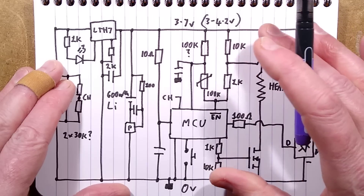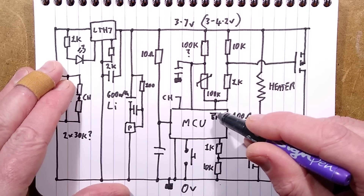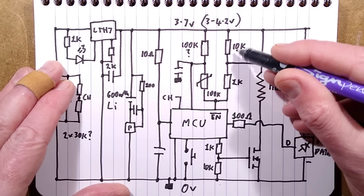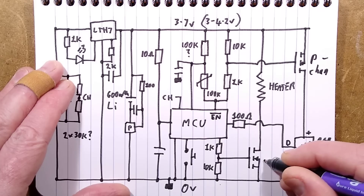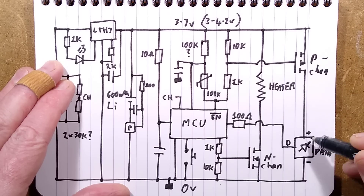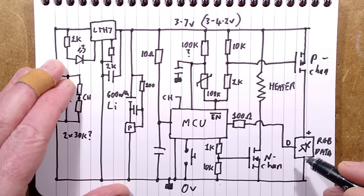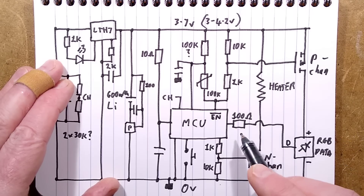There's a little capacitor there just for smoothing and stability. This also turns on a MOSFET via a 1k resistor, with a 10k pull-up resistor because it's a P-channel MOSFET. When it turns that on by pulling it to the 0 volt rail, it enables the LED. These smart LEDs do have a quiescent current draw because they've got active circuitry running all the time, so when the unit is turned off, it actually turns off the RGB LED too.